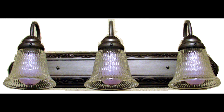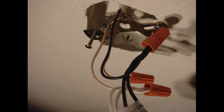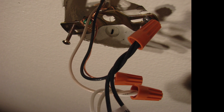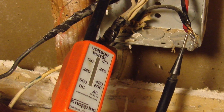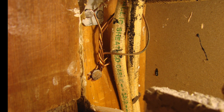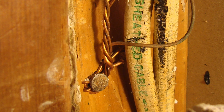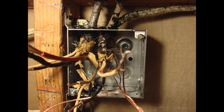Speaking of ceiling light fixtures, I get a lot of questions about people who get a light fixture, go to install it, and there's a ground wire on the fixture but no ground wire in the light fixture box. If it's an older home with a metal box, you can test the wiring to see if you actually do have a ground attached to the metal box. In older homes, they would run a ground wire and attach it to a nail or screw on the backside of the metal box. A simple electrical test can confirm if the box is in fact grounded. If you're doing a remodel and the wall is open, you can visually check if there's a ground wire attached to the mounting hardware of the box.